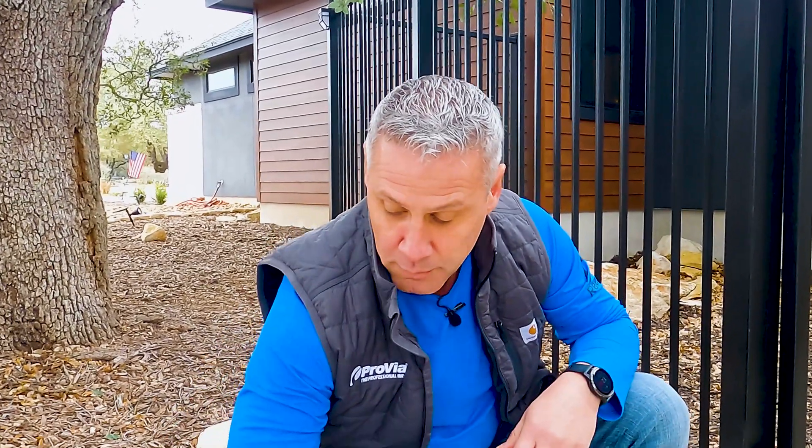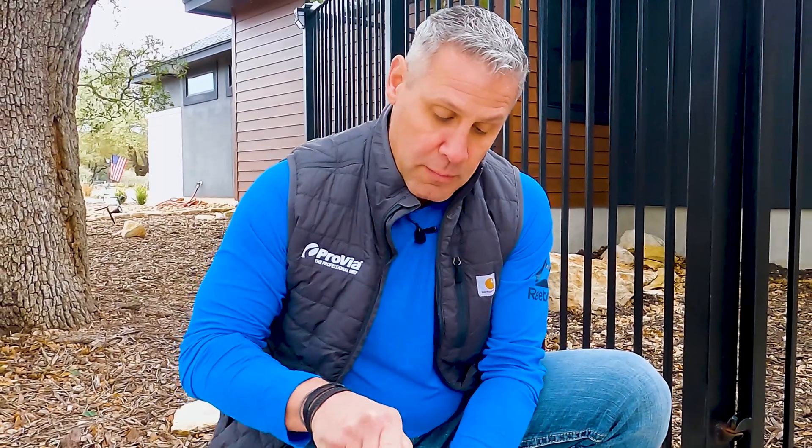There have been times where we can't coat the concrete because it's just too moist. There's too much moisture left in that concrete, and that's not a great conversation to have with the homeowner, but we always like to do the right thing and let them know it's not going to last long-term, and it's best if we don't do this project. So that's the first test we always have to run — we have to see what the moisture level is. There are ways around it as I said, but you always do need to make sure you know what that is.